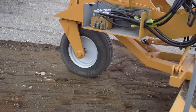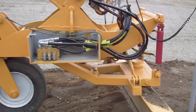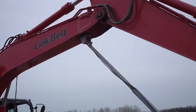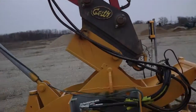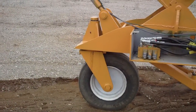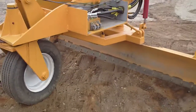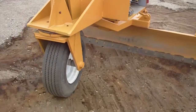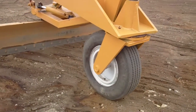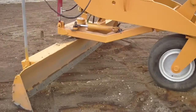It's got a caster for balance, and a valving system on the side that's open right now — I've been doing fine tuning. It has an arm that goes up onto the boom, with a distance between it and the quick coupler that creates a sort of parallelogram. A parallelogram keeps two surfaces even. I've extended that parallelogram quite a bit so that when this machine moves forward and backwards on the track hoe, it stays within about an inch or two.